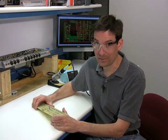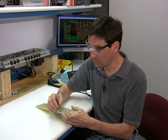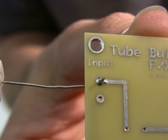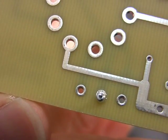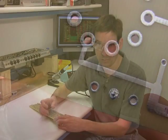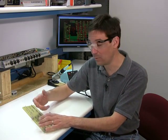After you've soldered a connection, you want to inspect it to make sure it's good. You want to make sure it's nice and shiny all the way around and that your component is held tightly inside — give it a good little tug without moving it so much that you break the component. Look around to make sure there's no solder flowing onto another connection — you don't want any solder bridges. A bad connection can be identified by not enough solder in the spot or hole, a grainy non-shiny appearance, or the ability to pull the component out of the connection. If you find you have a bad solder connection, re-solder it: remove the old solder, apply new solder, and start again. I hope this video has provided some helpful tips for improving your soldering skills. I look forward to seeing you again.